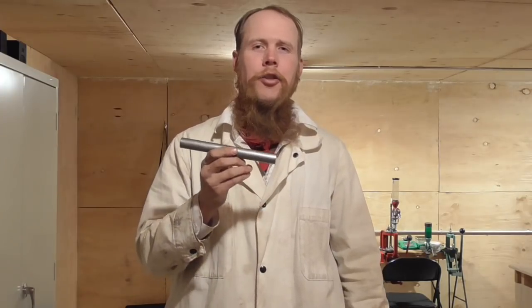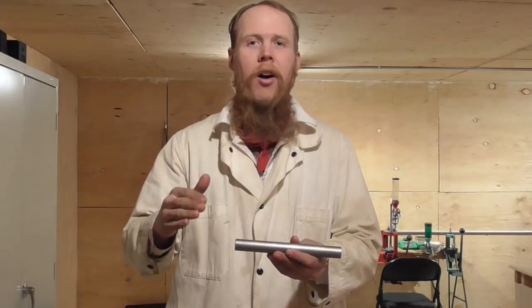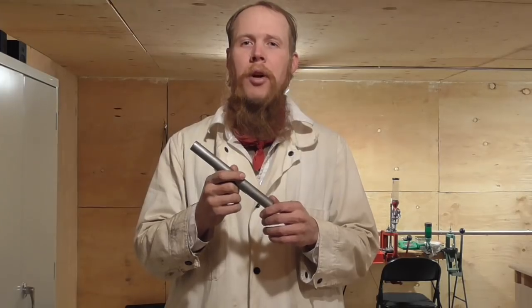However, there is actually a historical precedent for making gun barrels out of DOM tubing. Back in the early days of muskets and muzzle loading rifles, a colonial gunsmith making a barrel for a Pennsylvania long rifle didn't have our modern machine tools to bore out solid bar stock. He would take a piece of flat bar, forge it around a mandrel, and make something really akin to a predecessor of DOM tubing. I would hypothesize that modern DOM tubing probably has ample strength for musket barrels, muzzle loaders, and other types of firearms that operate at relatively low pressure.